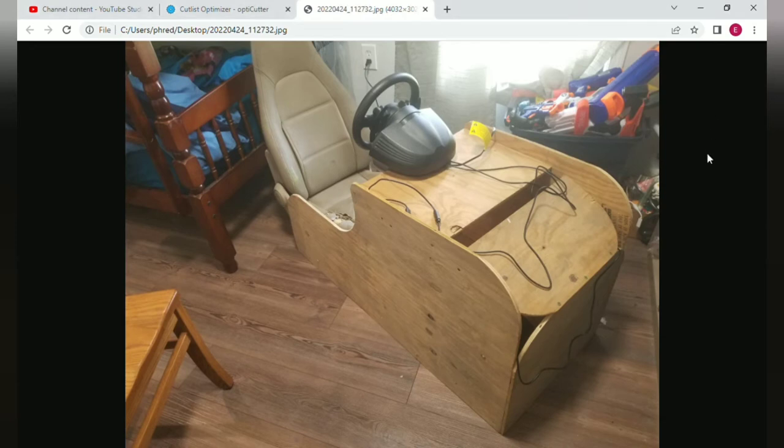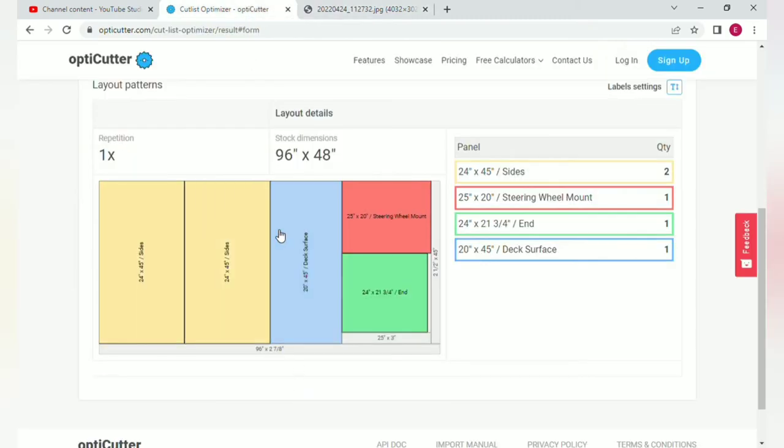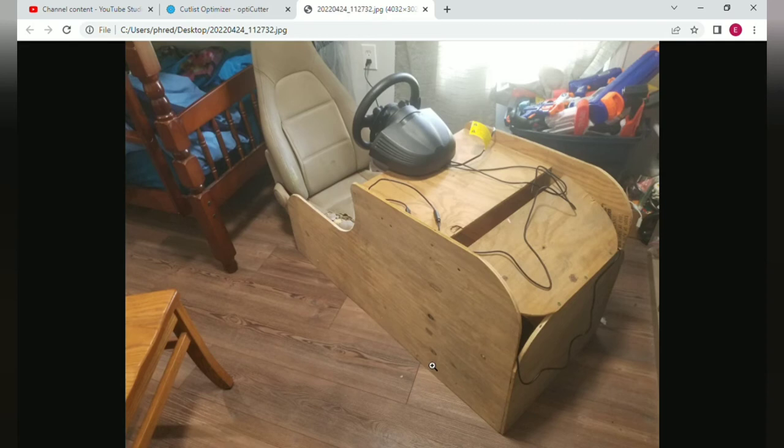Also, your 2x4s, you do only need two of those. So you're going to cut a full length 2x4, 8 foot long, is 96 inches. So you can cut your 45s out, 45 here and 45 on the other side. Remember, that's at our base, those 2x4s. And you'll have about 6 inches left off that stud. That's not figuring in blade width on this. Oddly enough, this calculator is figuring that in; I just put in an 1/8 inch of blade width. So it's calculated that as well, so you don't have to worry about losing that blade width.